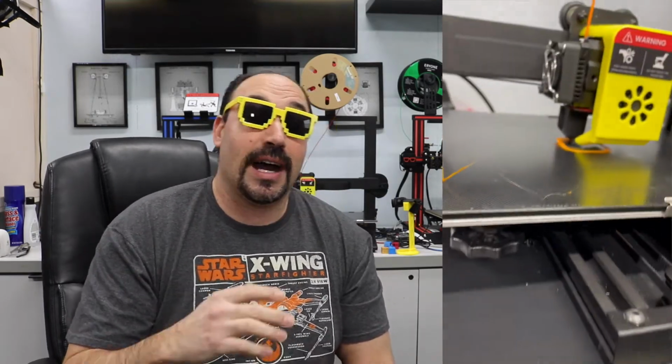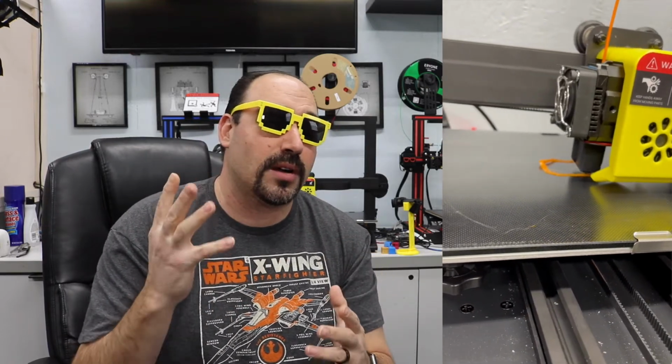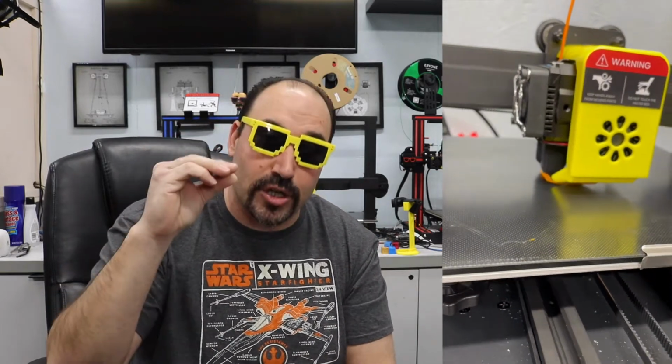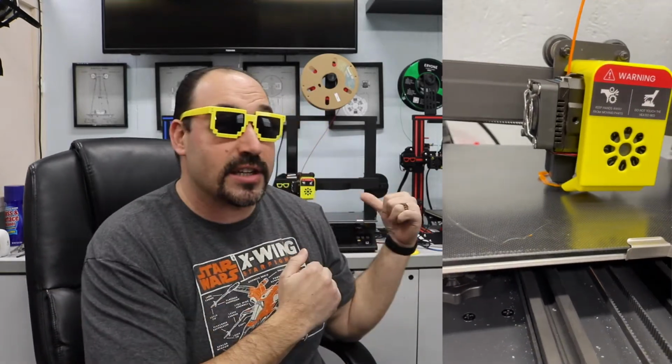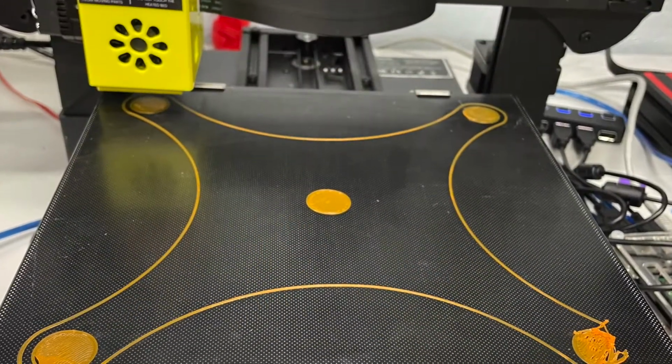This is what my prints are looking like right now. No adhesion. I have to print a brim in order for stuff not to pop up, and that all comes down to bed leveling. It's just not sticking. We're not getting that smush. So my goal is if I change out the wheels on this, the middle will be lower, so I'll get that smush. Now I'm getting kind of the corners leveled, but it keeps getting out of whack every time I go around to the 5 points.